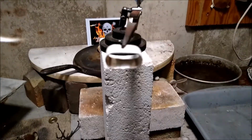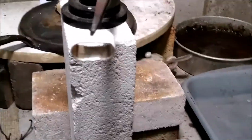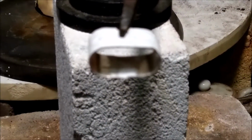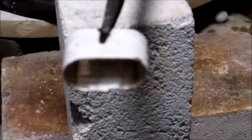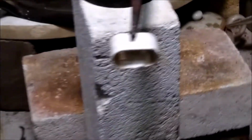Right inside there's 3 pieces of solder, right inside there, across the seam. Can't see it very well. I fluxed the whole crazy piece. It's sterling, and if you don't flux the whole thing, it's going to turn black on you. Awesome. Just kick that. See if I can get it back to where I had it.